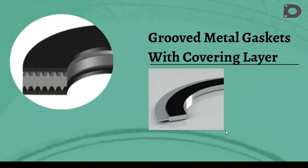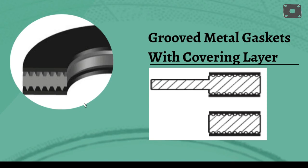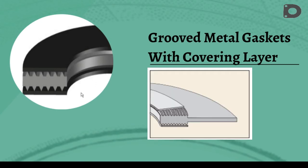Grooved gaskets have proven themselves in all industrial applications. These gaskets are found in industrial power plants and in the primary circuits in nuclear installations. Used either between flanges or in heat exchanger units in nuclear applications, power plants, petrochemical and chemical industries in the most difficult applications such as superheated steam, high-pressure hydrocarbon or chemical service, as the gaskets are used in applications where high pressures and temperatures are maintained and consequently high bolt loads need to be controlled.